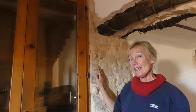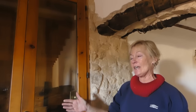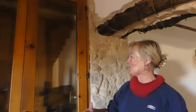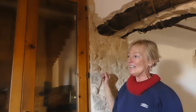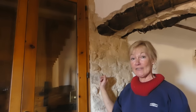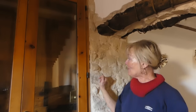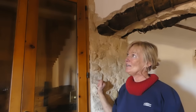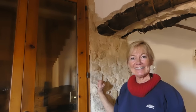But this last couple of days it's been coming from the south, and this door is south facing, and literally as you pass by on the way to the sink or something, it's blowing a hoolie through these gaps here. So that is why it's now become a priority, and today we're going to make some burnt sand mastic and patch up all these gaps to make the house even more weather tight, if you like.